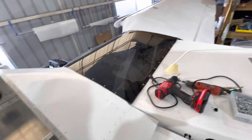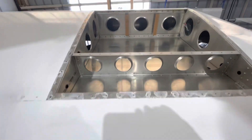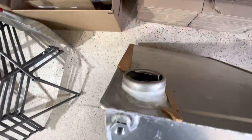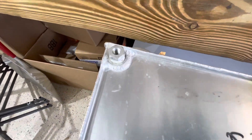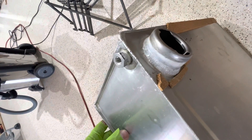We pulled one side wing tank because we needed to add a vent line. The tank actually came with the bung in it — it just wasn't utilized. You can tell if you put your finger down in here, or you can use a little mirror. We're putting in a three-eighths to quarter adapter because that will bring it out a little bit and we can still get the tank in there.